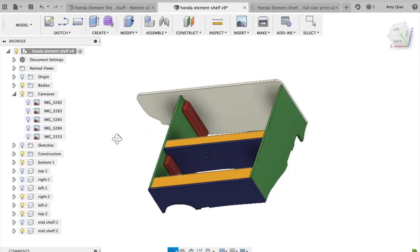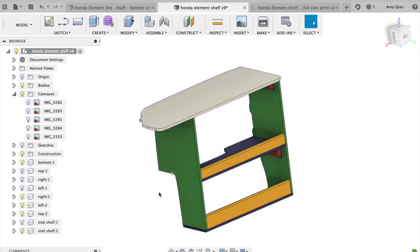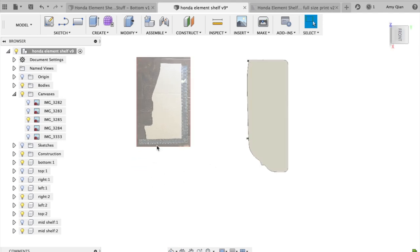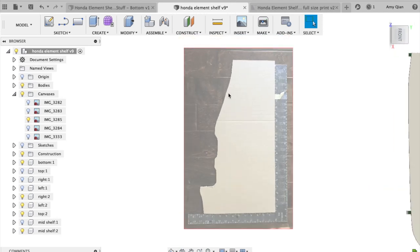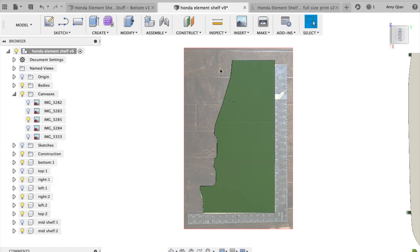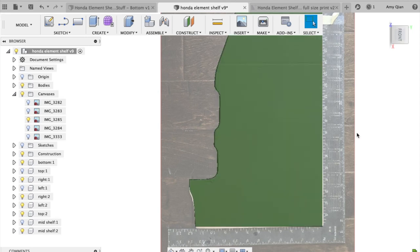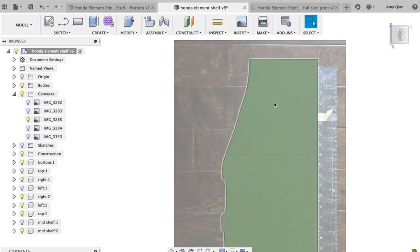For those of you who are curious, here's a little bit on how I actually made the 3D model. As I said in the previous video, I had traced cardboard templates the first time around and that's how I cut out the pieces for my shelf. To make the digital models I took a photo of those templates with a ruler for scale. The image is slightly distorted due to the camera lens, so I would sketch over that and roughly trace the contours, correcting for distortion by measuring the actual cardboard piece. Finally I iterated a few times by cutting out the cardboard pieces on my laser cutter and comparing the new cutouts to my original templates, so the final plans are pretty close to the original cardboard templates I used.